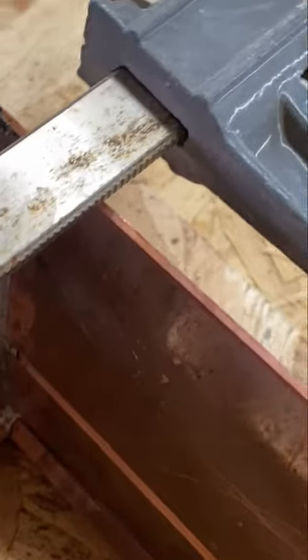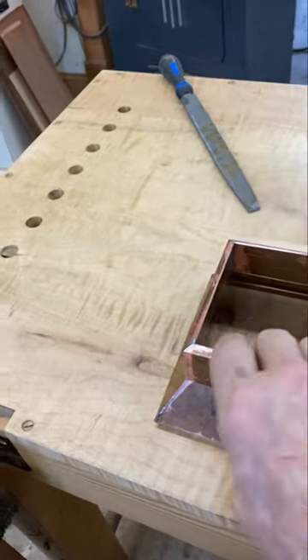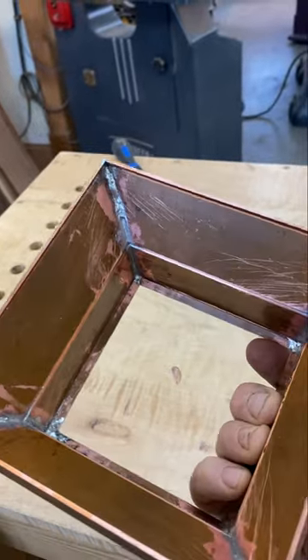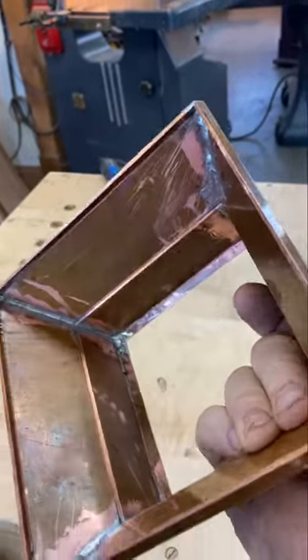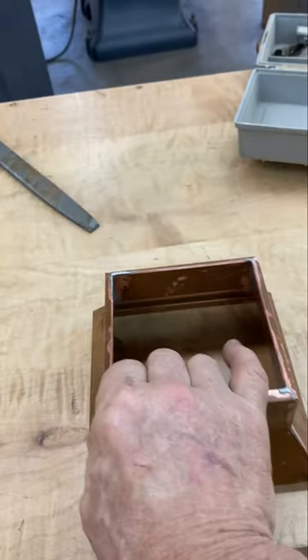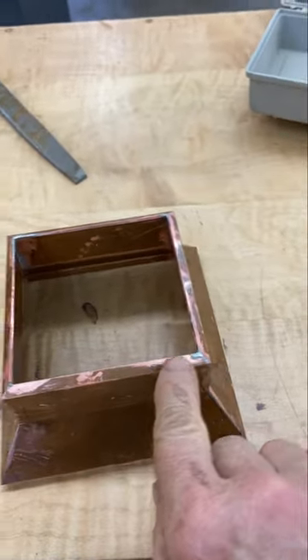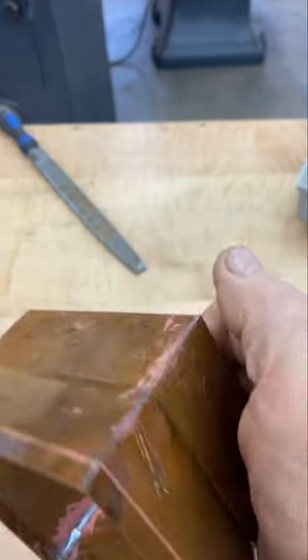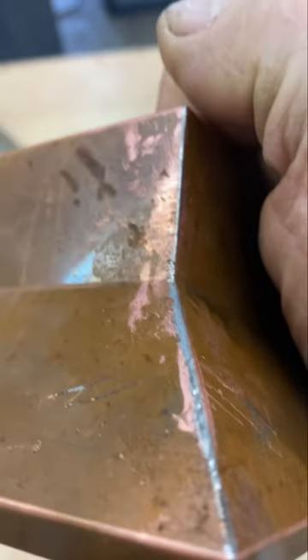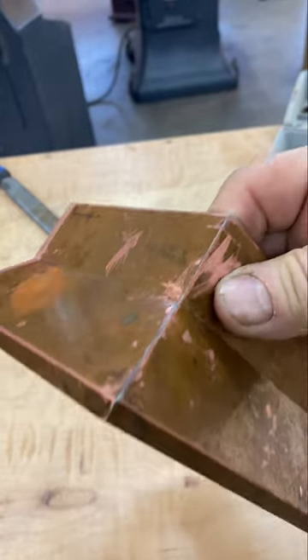That's a proper flashing — nothing wrong with that flashing at all. Just letting her cool down, we'll pop it out and clean it up. It's flat. Ain't that a nice flashing, the way they used to do it. That gauge is a little easier for the untrained to work with — holds rigid and you can solder it fairly easy. Now we're going to clean the exterior, wire wheel the solder off because we only want to see copper. The actual joints are very good.